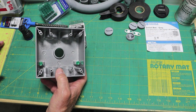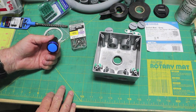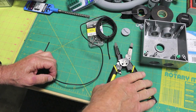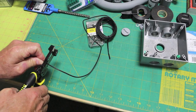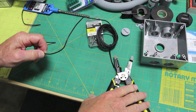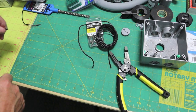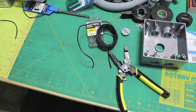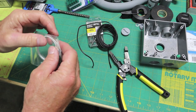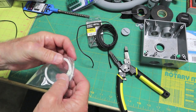Hopefully we end up with some kind of an indicator system that'll work. The life of these LEDs are slated 20 to 25,000 hours; they will be illuminated at all times. This is 18-gauge stranded wire — we're using it because it's all we got. According to my research, it's good enough. You can see what size of wire they're using on the white one; it's even smaller, probably 20, 22, or 24 gauge.